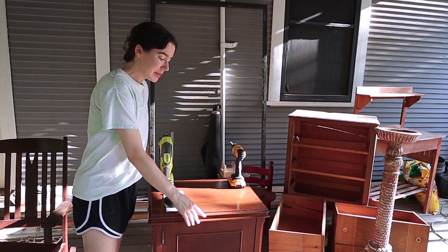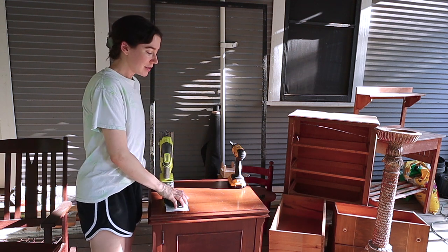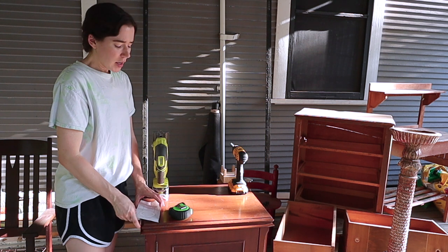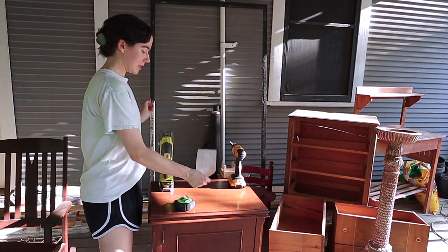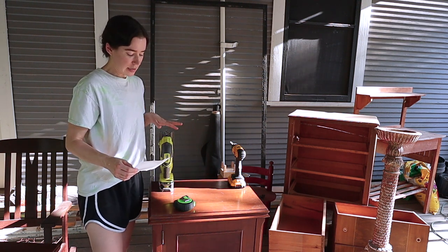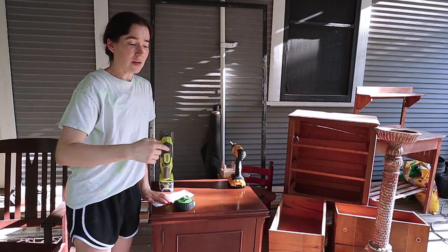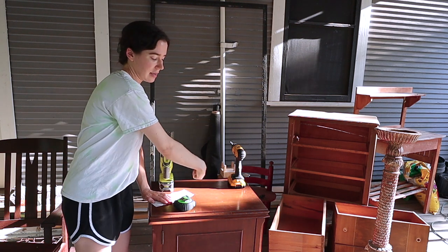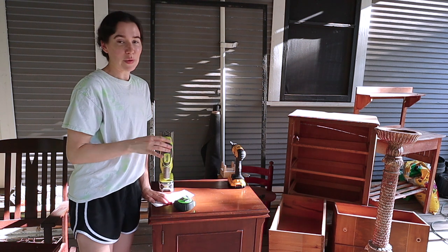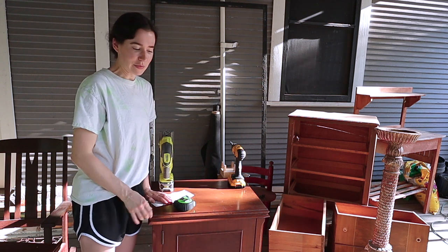It's time to install the sink, which means it's time to start sawing into this cabinet. We're going to try to be as precise as possible so that we don't make any unnecessary cuts. The sink came with a template, so this is what I need to cut out for the sink top. I have my drill here to make the pilot holes on the corners and then my jigsaw to cut out the hole. Once I cut this hole I will take the cabinet inside, figure out what I need to cut on the back for the plumbing to come in, bring it back out, cut that, and then we'll hopefully be done. It's pretty straightforward but also nerve-wracking because it's cutting into a beautiful antique cabinet.